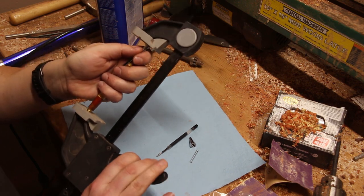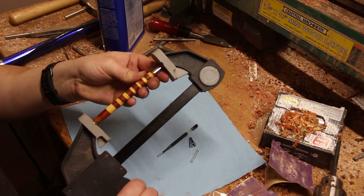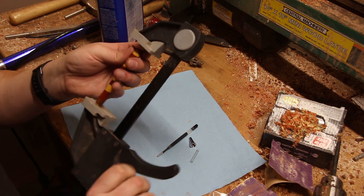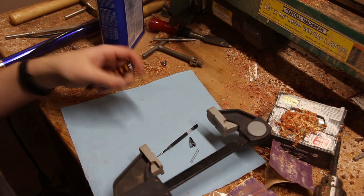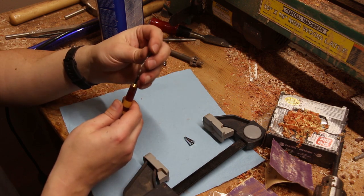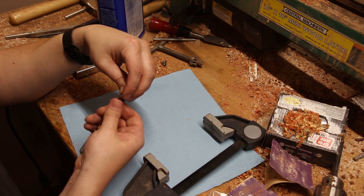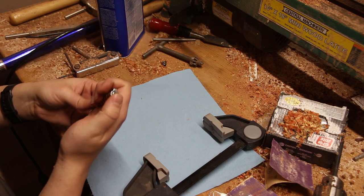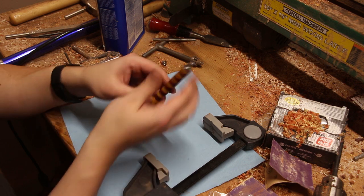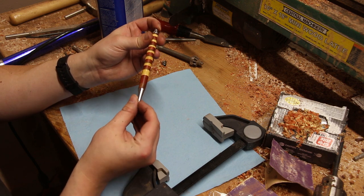So now that is fitted in there and the click mechanism is riding on that little piece that I cut off, so now it's not going to move. If you didn't have that in there and you push the click mechanism, it could slide around inside the tube, and obviously you don't want it moving or it's not going to click correctly. As you can see, it's currently depressed because there's no tension pushing back against it. Here I'm inserting the ink refill and putting on the nib with the spring, and that is pretty much all there is to it. Now I can press it and it pushes back — the click mechanism will release and it works just fine. Then I pull off the little wax that is on the end of the ballpoint to be able to use it.